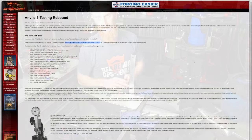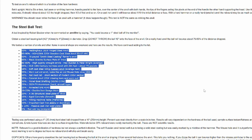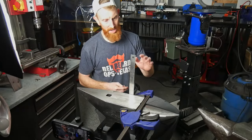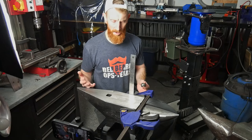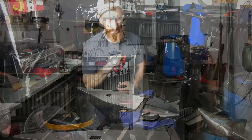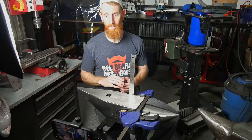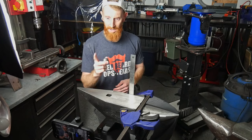The Anvil Fire website has a ton of data on 10-inch drop tests with a one-inch ball bearing on different anvils and materials, so that's what I'm doing here. I clamped a ruler to the side of the anvil and positioned a camera flat and perpendicular to the face to capture slow-motion footage. I'll show it in real time first, then we'll look at the measurements.